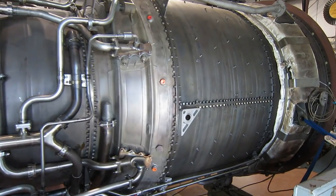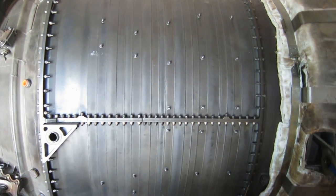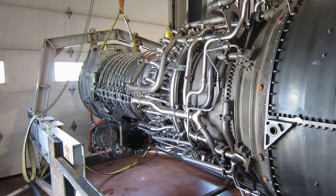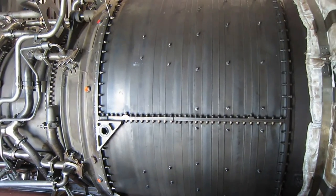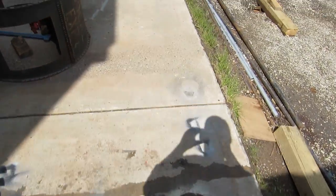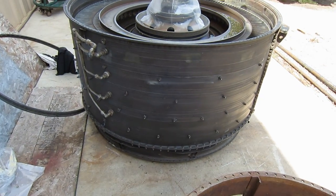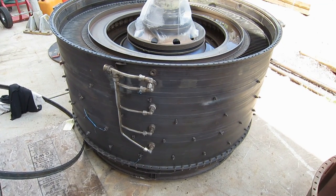For comparison, this is the six-stage industrial power turbine mated to the back of the LM2500. There's an insulation blanket. So there's the LM2500 there, mated to the 2500's power turbine for industrial use — six stages. And as we go outside here, this is the aircraft version of the same power turbine. It has five stages to allow for some residual thrust to be produced by the jet exhaust of this unit.